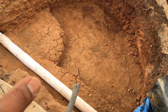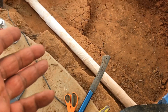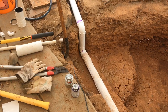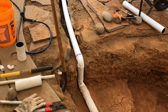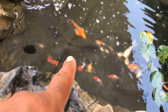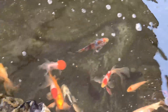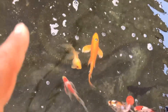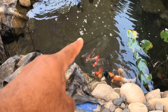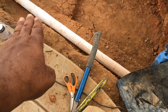The pipe goes under your pond liner — rather be safe than sorry, because if it bubbles up you'd have to throw a submersible pump down there and try to pump water out, which is a pain. It's not that much money — ten dollars for ten feet of perforated pipe, a couple dollars for the elbows, and another ten dollars for the solid piece, so you're probably looking at about twenty-five dollars total. You can see the pipe runs right there through the pond and stops right there — once we add pond pebble to the bottom you won't be able to see it at all.